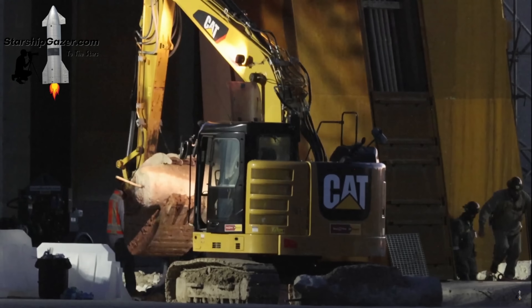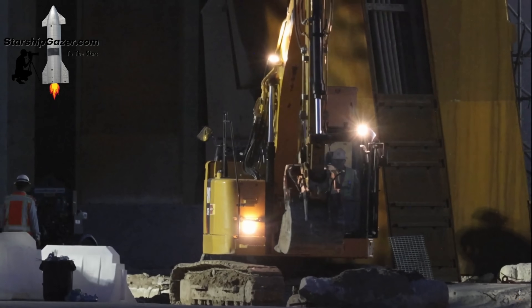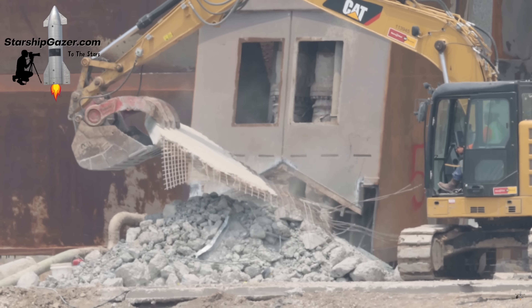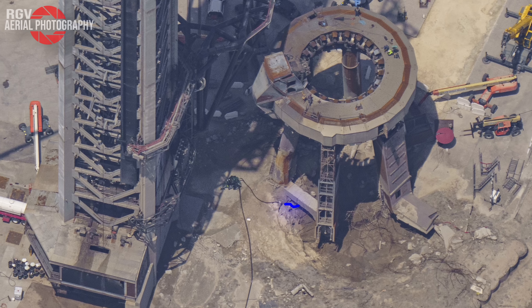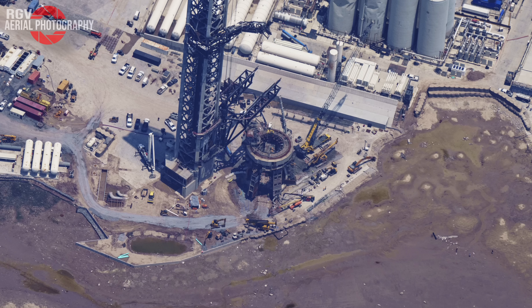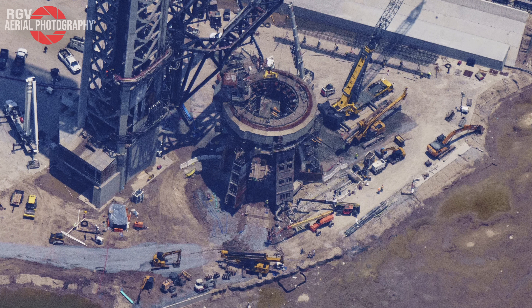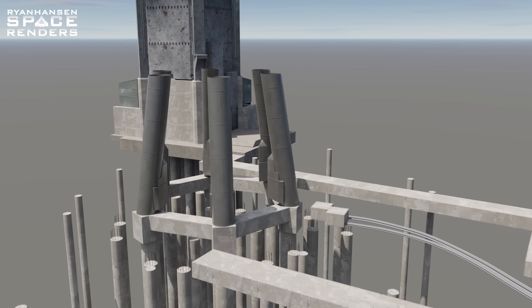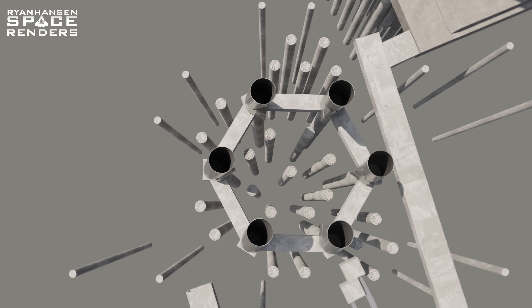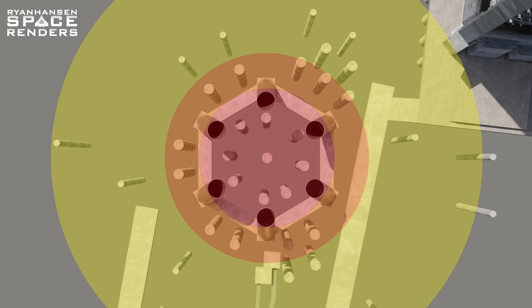The first step of this process was to excavate all of the old material from under the orbital launch mount. This includes getting all of the damaged pilings out of the way and removing any debris left over from the failed blast surface. During this time, water was constantly being removed from under the OLM using several pumps. After the excavation process was complete, they backfilled the area with sand and gravel in order to prepare for the new auger pilings. There were two separate types and sizes of pilings used under and around the orbital launch mount, installed in three separate zones, each serving a different purpose.